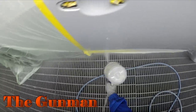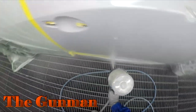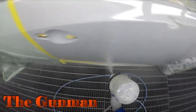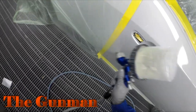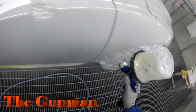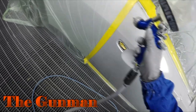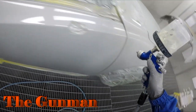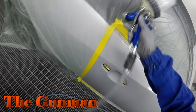I ended up doing the grip and rip technique, which is just putting that first coat on nice and wet but not too wet, and then following that straight away with another wet coat. It's really not rocket science. The first few times you do it, it seems a little bit scary — it just doesn't feel right. But once you get the hang of it, it's a very efficient way of painting, and it's quick as well. You use a lot less paint doing it this way.